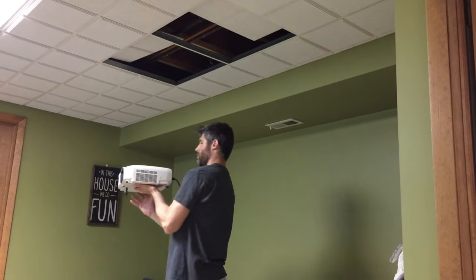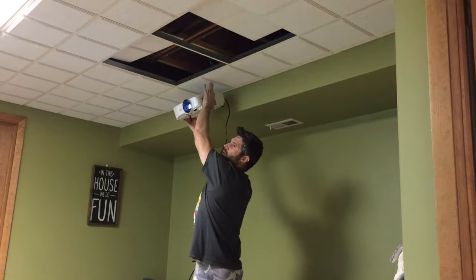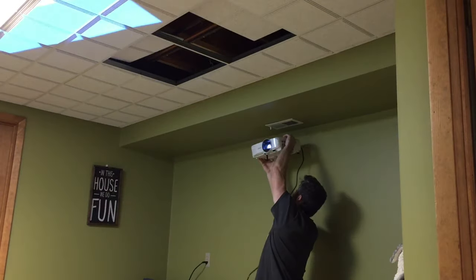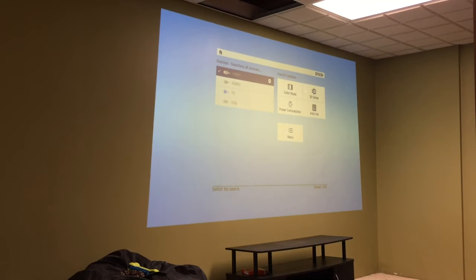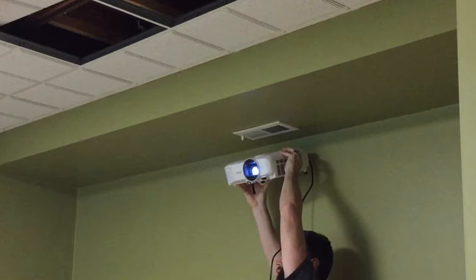First thing — where will the projector be located? Ideally it would be hanging from the drop ceiling, so the HDMI and power cord could go straight up into the drop ceiling, making cord management clean and easy. Unfortunately, this results in a screen size that's too small. Moving the projector all the way back, it is under the vent — not ideal, but the screen size is right: a 10-foot screen measured diagonally. A third option is to cut a hole in the wall and have the projector on a shelf in the adjacent room, but this results in a screen that fills the entire wall, which was determined to be too big. So it is hanging below the vent.